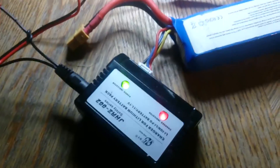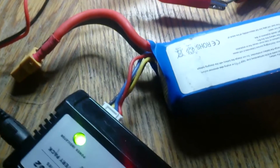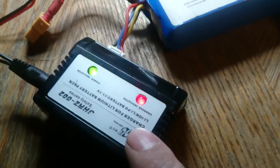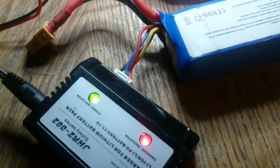I have the stock charger hooked back up to the 2,700 milliamp battery with my voltmeter attached for amps. It's charging at 0.68 — so basically 700 milliamps. If you do some quick math: charging at 700 milliamps, plus whatever the unit takes itself, we'll say 0.7 total. If you multiply 0.7 by 3, you get 2.1 amps — that's basically three times faster using the IMAX already.